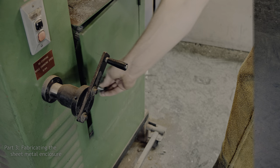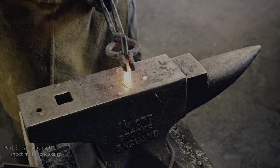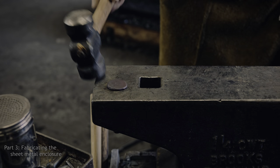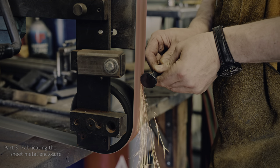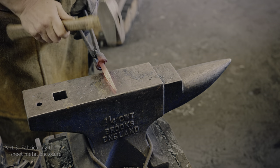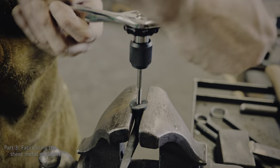I thought I would just buy some kind of latch at the hardware store, but they don't really have what I need. Instead, I'm taking inspiration from the trusty metal bandsaw in the shop and decide that forging the latch handle is the way to go. This is definitely one of the benefits of doing all the work in a blacksmith shop. While precision is something I'm limited on, creative transformation of steel is always an option. The flange I'm forging here is meant to secure the handle on the outside so that it does not move through the hole where the handle engages the latch. One of the challenges here is to keep everything centered. The handle for the latch is finished and instead of using the transformative power of blacksmithing, I will just weld on the square driver.